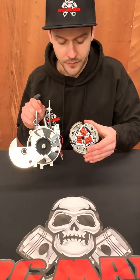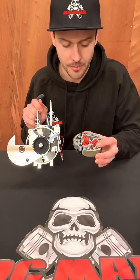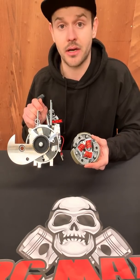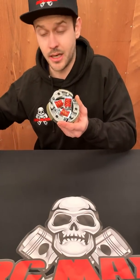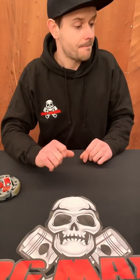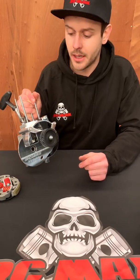The beauty of Kevlar is it just doesn't generate the same amount of heat where you've got the Kevlar rubbing on the steel. This Kevlar matrix is a properly designed clutch material — it doesn't generate the heat that steel-on-steel does, so we don't get the issues that come about with steel clutches. We're so excited about this. In terms of the engine lineup: we've got the 40, 46, and 50 GT engines as a reliable first step up from 34s; the 55 and 65 supreme as really high-end screamers — the 55 I think will be a sweet Losi engine; and if you really want a monster, we've got the 71 and 80 supreme.